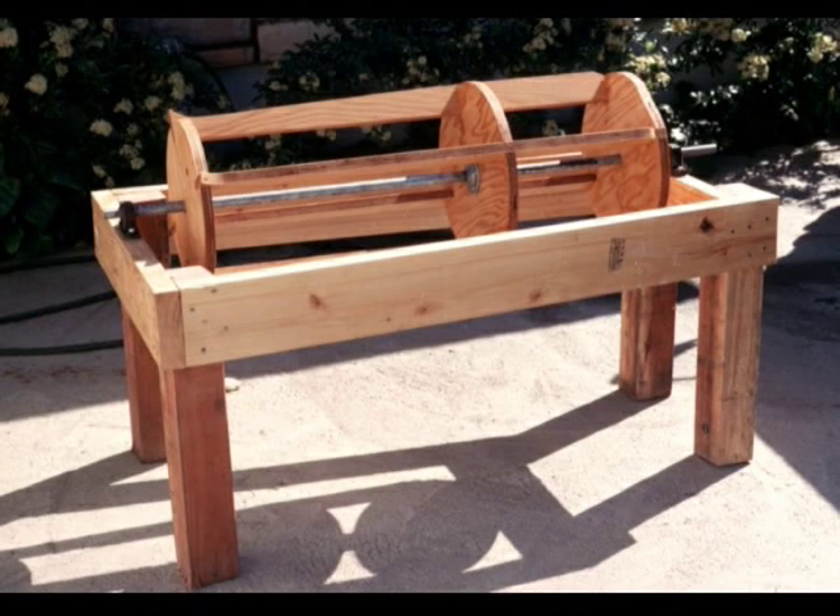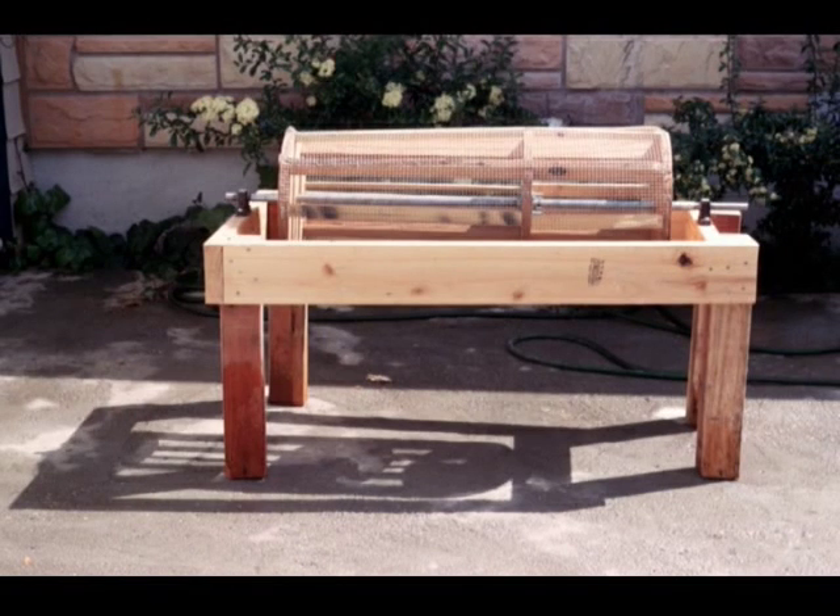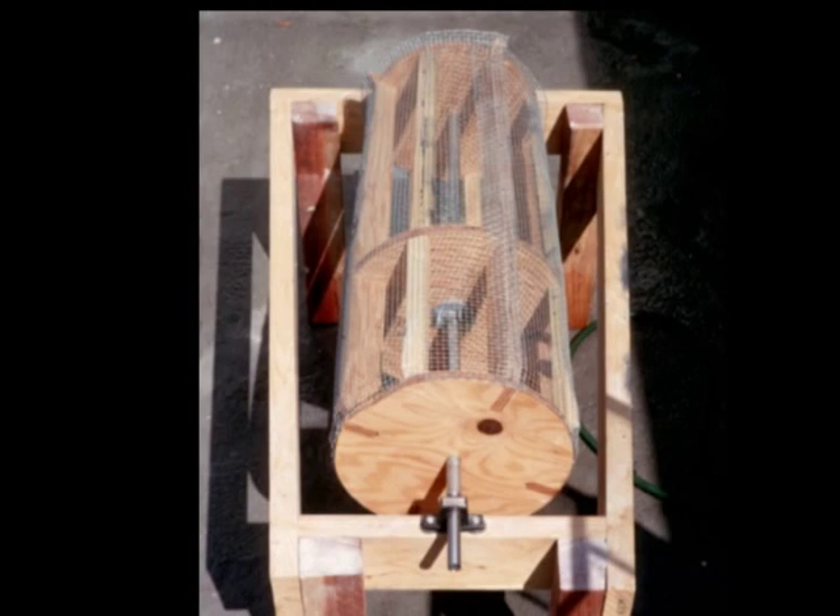For the tube assembly, the armature was set up — this time I intended to do the full diameter of the tube. I set up the working bench, set up a couple of bearings with pipe threads attaching the armature structure, and then floating it in a fixture so it's free to rotate. The tube master model will be built up on this armature. Onto the assembly I applied a wire or hardware screen to provide a surface to build up on.